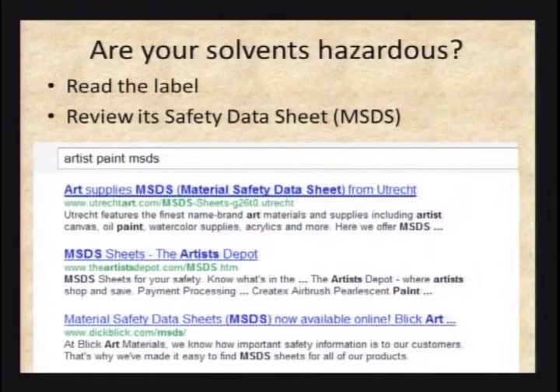You can go to their websites, find whatever product you're using, and look for a small icon or the letters 'MSDS' — click on it and it brings up a multi-page form with the product name at the top. The first thing you do is check to make sure that name is actually the product you were looking for, because you don't want to accidentally click on the wrong product — one that's much more hazardous — and get scared unnecessarily. After that, you'll find the hazard statement: a short, succinct statement of the hazards this material can pose to your health.